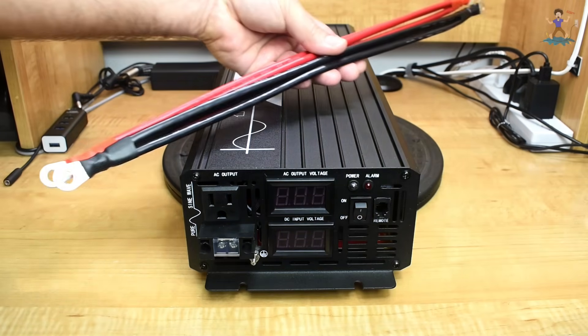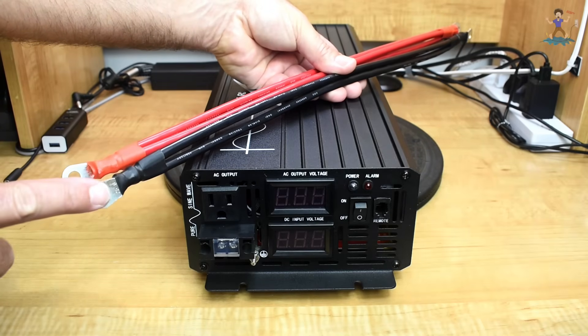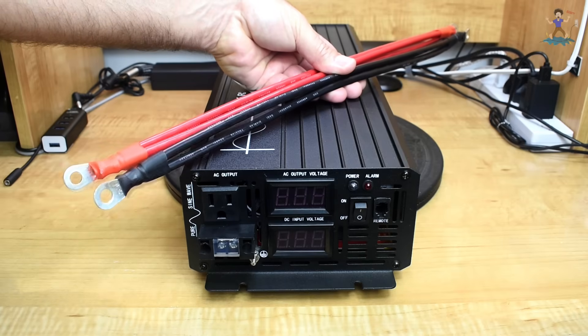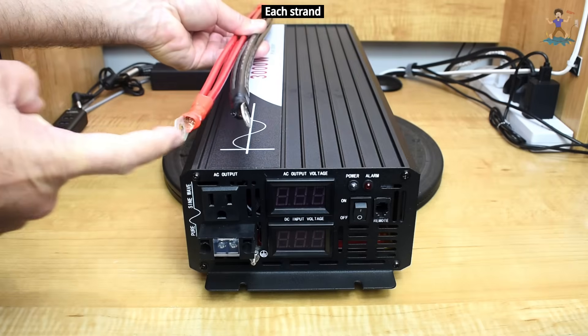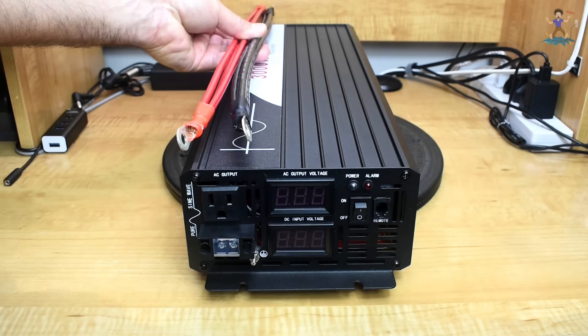Included with this unit you get cables. I checked them — I scratched them — and it's definitely copper, so it's tinned copper lugs and solid copper wire throughout. I looked at the cut end and it's copper color all the way through, so it's definitely not copper over aluminum.